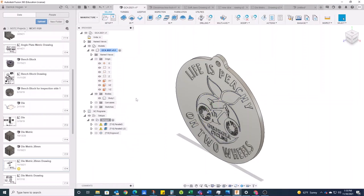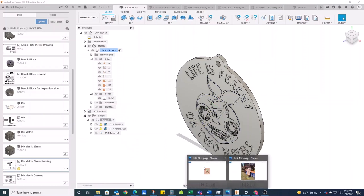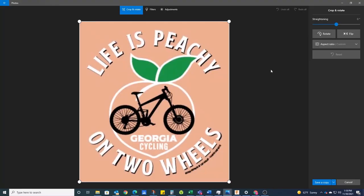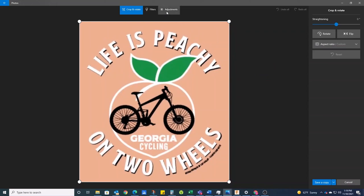The first step is to turn this into some type of file I can use — either import as geometry or import as a canvas in Fusion 360, which works pretty well. The best case is to convert this to geometry. You can import SVG files and DXF files directly to Fusion 360; they both have advantages and disadvantages. To do the conversion, you have to turn the image into that kind of file. I've found it works best if your design allows the most detail, and one key thing is to adjust your color.